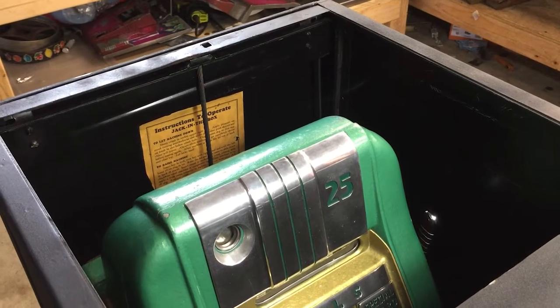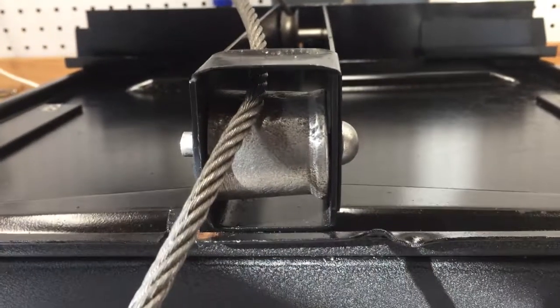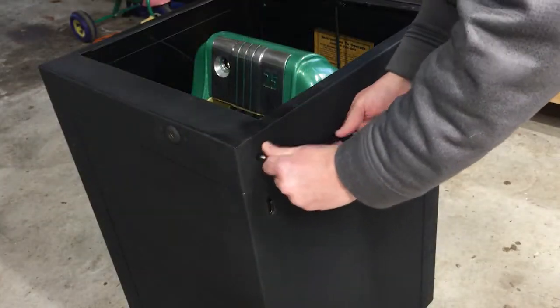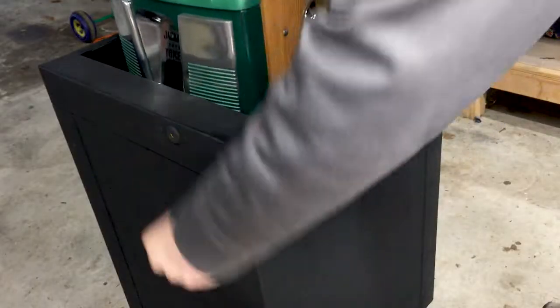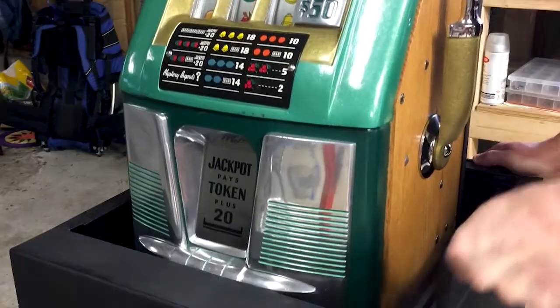With the machine in the stand on the platform, the steel cable connects from the back of the base and feeds through two pulleys on the bottom of the platform — one in the back and then through one in the front. From there, the cable wraps around the steel spool and then connects into the spool itself. As the crank is inserted into the spool and turned counterclockwise, the steel cable wraps around the spool, tightening the cable and raising the platform. The ratcheting sound comes from a dog that inhibits backward movement as the platform is raised, and the inner frame arms guide the machine smoothly and straight up to playing level.